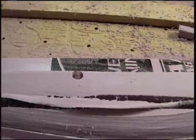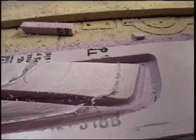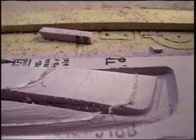But anyway, I think I got the parameters down for the kind of smoothness I want, about a 1/100 of an inch step over. Actually, I think I was running 5/1000, but that should be doable. And once I get something more substantial in here, besides this foam, which is really flexible, it was moving around on me.